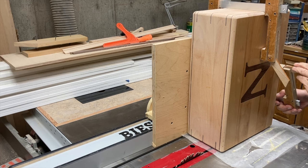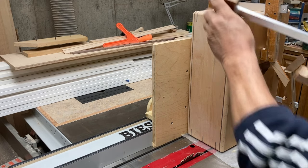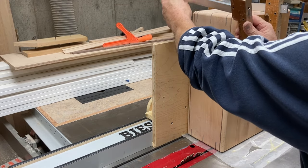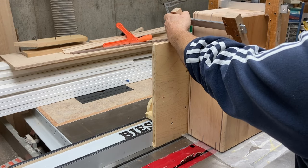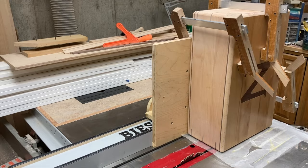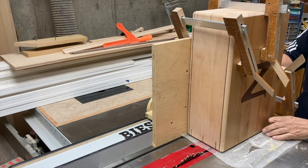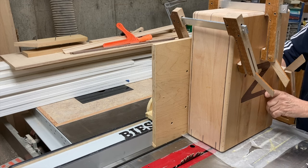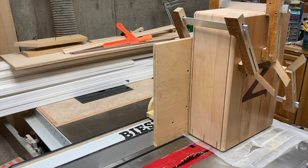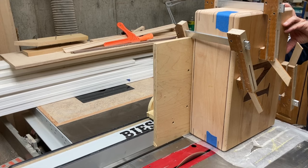I've used it as a spline cutting jig — I had two boards on it at a 45 degree angle to hold the box at 45 degrees. It's the same jig I used to cut these splines, and now I'm using it to hold the box at a uniform distance from the blade, pushing the box through with a shallow depth setting just over the thickness of the boards, which are about three quarters of an inch. Here I'm making the first pass through the box.